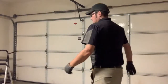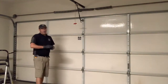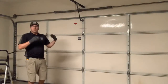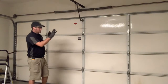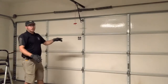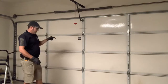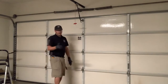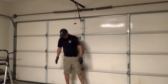Probably not — that's not a very reliable approach. You want to do it right. You can guess if you're willing to do it again and again, but you have to get the door balance just right. We have a family chart that tells us for every door in existence the correlating spring based on weight, height, and size. First I understand the size, but now I need to know the weight — and you can only tell by weighing the door.